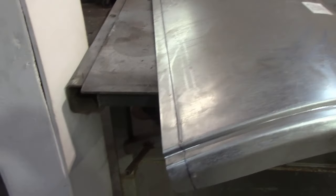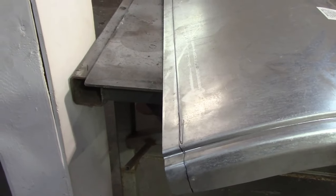I started out going to do it that way, and then I didn't do it that way. I said I wasn't happy with the way I did it, but it turned out okay though. I made it work, because I just didn't want an overlap seam inside, even though no one's gonna see it when the door panel's on. Let's go, oh God, this bloody door, hang on. I didn't want to have it sit overlapped. So you can see, I've got it all nicely butt welded, all the way along. No warpage, no nothing going on. You can actually see down in here where we just plug welded it. You can see it coming through. That's a good sign, you want to see that.